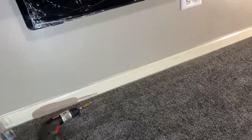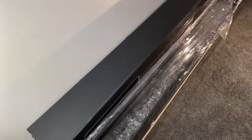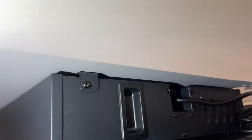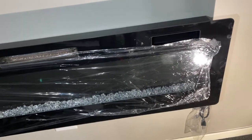Guys, when you're putting those wall anchors in, it's very important to note: you screw them in slowly, guys. Do not twist them in because they'll strip out and then they'll come off the wall. Look how flush that mount is, guys. That's what you want. That mount is flush. It's not going anywhere. If you over-tighten those anchors, guys, they're useless. They'll just come out of the wall, guys. Look at that. This is perfect. Perfectly installed. All of them are going to hold on for a minute.